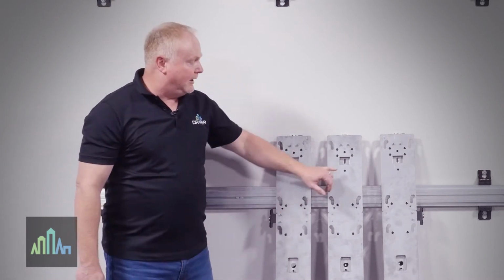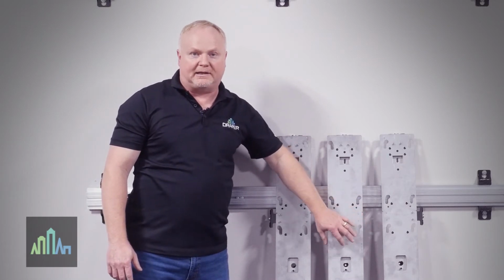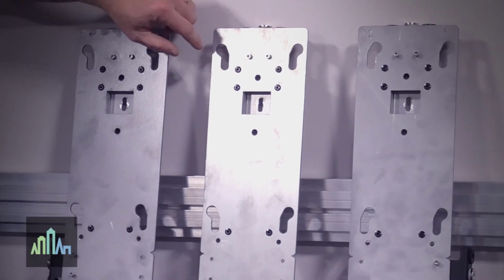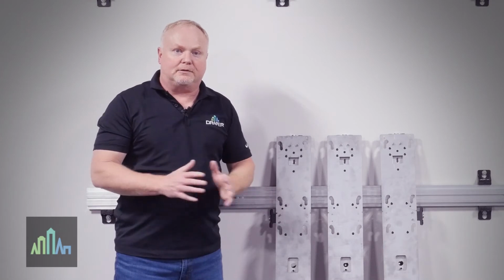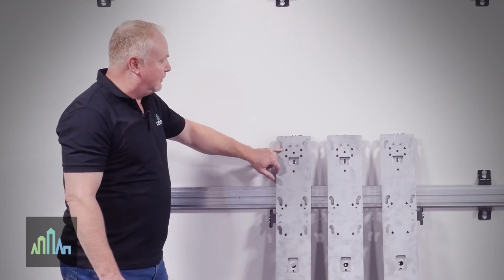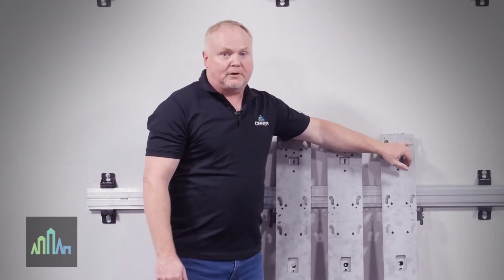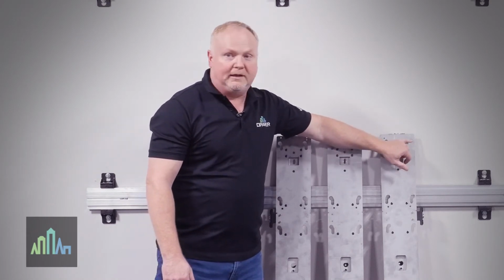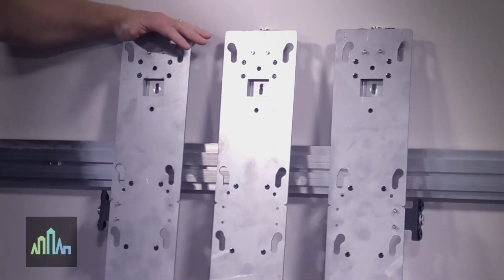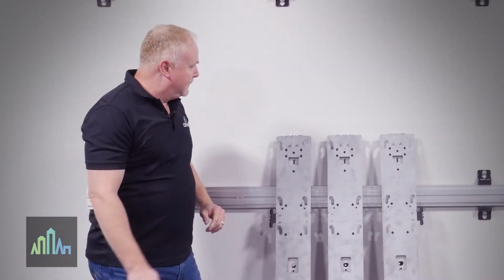We are today demonstrating a center axis hang, so you're going to start hanging the LED product in the center. So the vertical rail actually has two different keyhole slots, one going to the left, one going to the right. Many of the products also start from left to right. So a lot of them will have keyhole slots that are shaped with a larger hole on the top to the left. If it starts to the right or ends to the right, then you're going to have a keyhole slot for this. Make sure you are laying these out correctly and hanging them on the horizontal rail in the order that they need to be, based off the product you have.